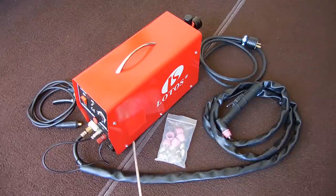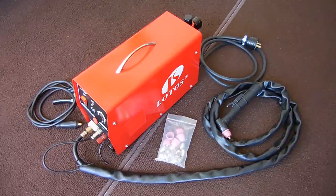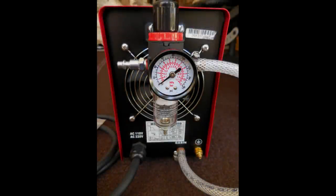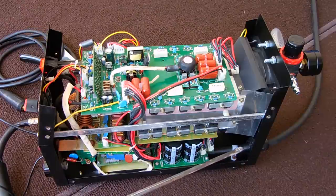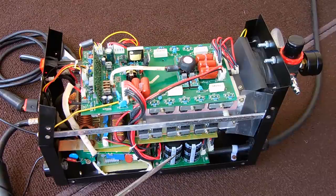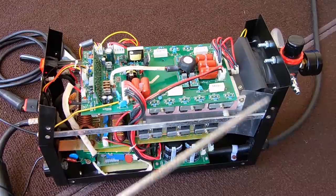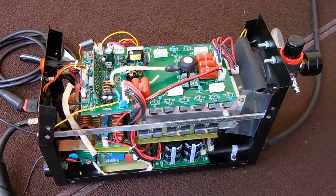I also noticed when I turn this on there's a sizzling and whining sound coming from this part of the unit. Now when I take all the screws off I'm going to show you exactly where it's coming from. If I'm lucky it's only going to be a faulty power supply board which I can inspect and hopefully repair. Right over here is where the power comes into the unit — it goes to the on/off switch, from the on/off switch it loops all the way back and goes to this power supply board. I'm hearing a lot of the sizzling and whining noise coming from between these two boards. If the power supply board is faulty, that's going to cause the fan not to turn on and prevent the plasma cutter from working.